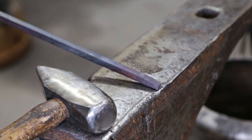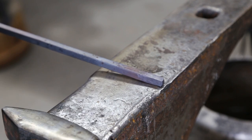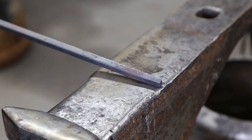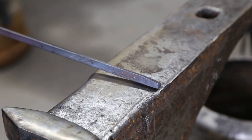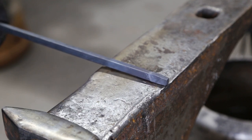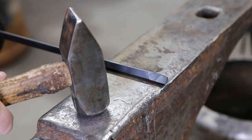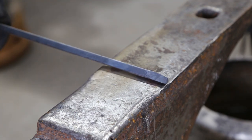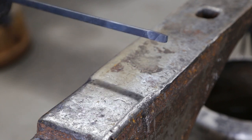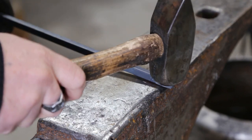As you can see, I strike three to four times and then rotate the bar stock. This is square stock, and my wrist does not rotate all the way around, so tapping gives me time to rotate the material. This may not work for you — you may hold the hammer up, rest it on the anvil face, or something else entirely — but for me this works. When drawing material out, I'm going to hit half-on, half-off.